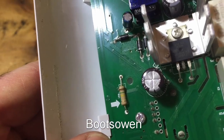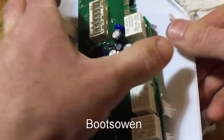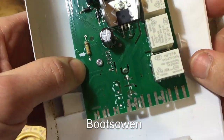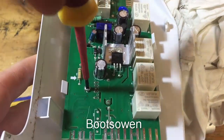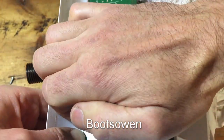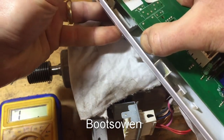What I should be doing is testing these and getting an open circuit, then when I put a jumper cable across the middle one to the gate - the one on the right - I should get continuity. But because it's already got continuity from the start, it's just stuck closed. That would explain why it's just revving constantly whenever the machine turns on. We're getting continuity across all three and I don't think that's right. It's a BTA 316-800B - I've ordered a new one and I'll replace it.